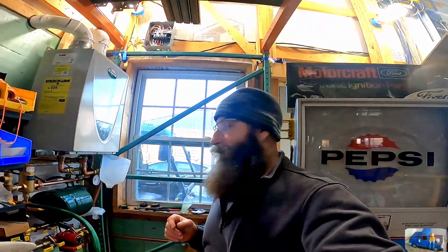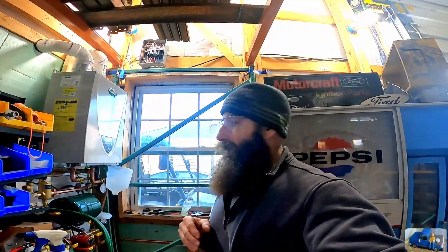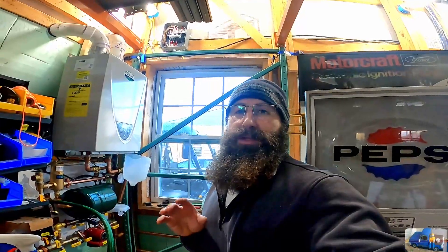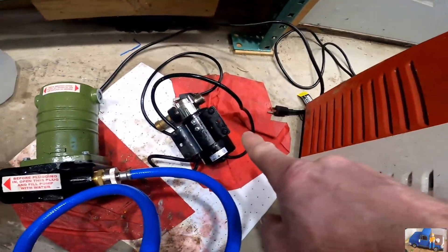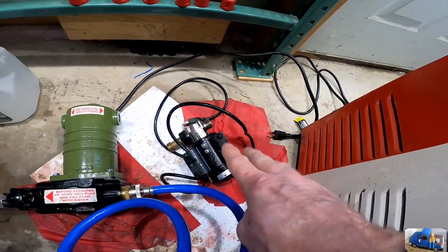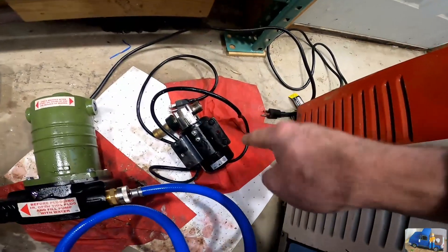It's the very next day. We had the boiler up and operational last night — the integration panel was pumping fluid throughout the system and things were looking good — but unfortunately the system shut down prematurely because we lost pressure. We didn't get the system filled properly, largely because we didn't have the right pump. We were using a small transfer pump when we needed a much larger half-horsepower pump. With Dad's help, we're borrowing his half-horsepower transfer pump. We also made a couple of fundamental errors in how we rigged this up.